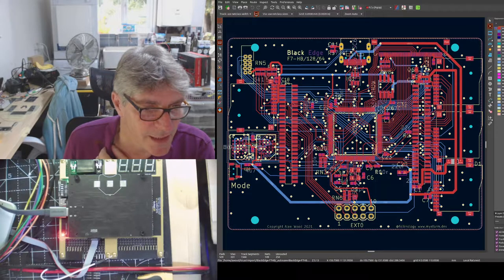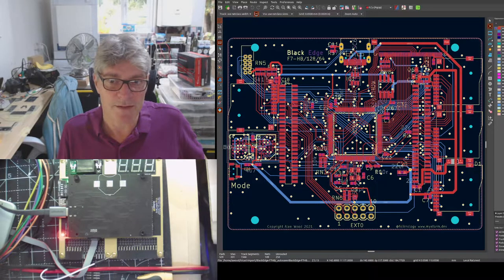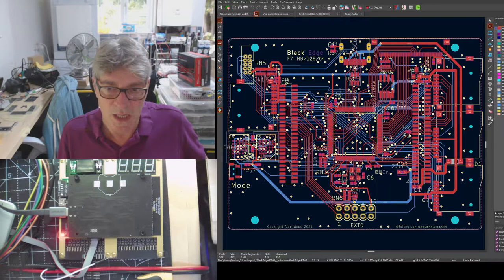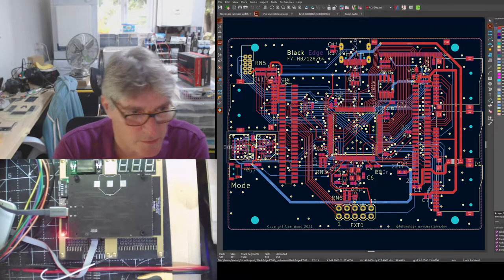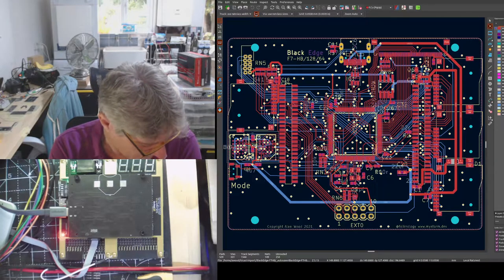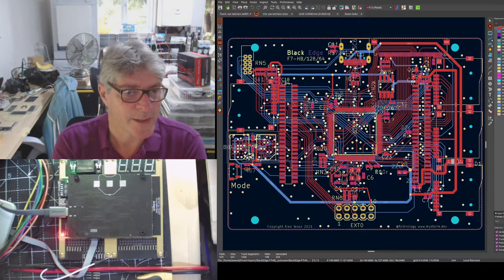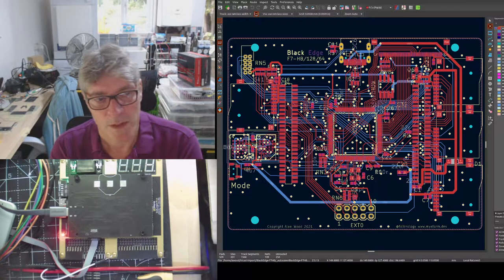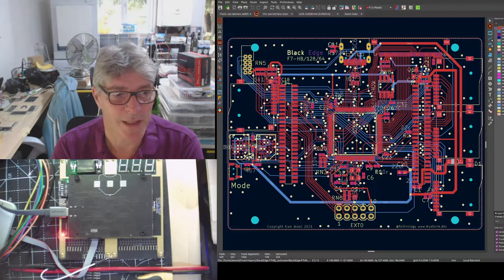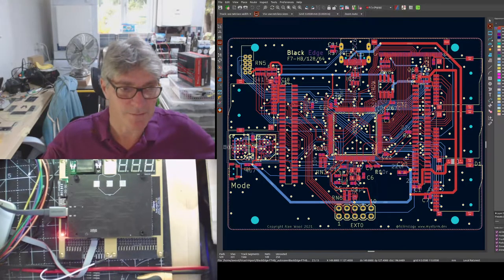Anyhow, here. But you've got the ADC here. So I did think, well, maybe not connect the mix signal here. Take the mix signal to the LED, for example. And then use this for 5 volts. So what's your argument, or what's your thinking, Laurie, on having the 5 volt there? Because obviously you're thinking about something, thinking it'll be useful. And I certainly was thinking, unlike a blade where you don't get the 5 volts, that could be handy, right? So, do we do the 5 volts or do we do the mixed signal? We can do either.